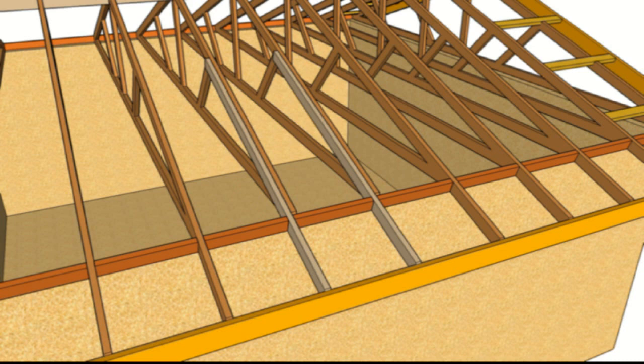You might need to remove a section of the fascia board. When the rafters are sagging and the fascia board has sagged, it's got a warp in it. You will need to remove a large section of the fascia board. How many roof trusses you repair is up to you. If you have a sag in about a 12 foot span, for example, you can use two rafters in the center to pull the sag out, then add furring on top of the other rafters where they are sagging, and use those rafters to reattach the new fascia board. If you're having problems sliding the rafters in, you can always remove the fascia board — most of the time it's going to have to be removed anyway. Keep that in mind while you're planning your project.